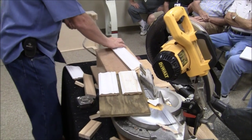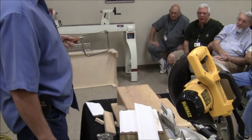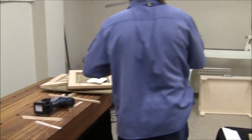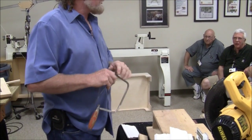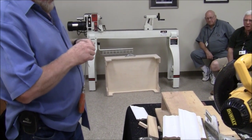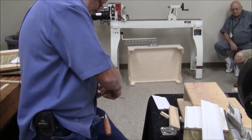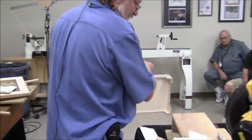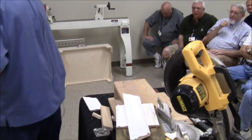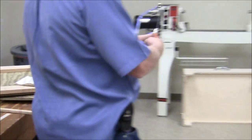Most people can take that crown and go ahead and lay it flat and cut it. Everybody knows you cut with a coping saw on a pull stroke. No, you cut it on a push stroke. The reason is because if you cut on a pull stroke, as you're coming through the face you start to rag — splinter — your face. This is just primer-grade, what Home Depot sells. So we would make up a nice little jig — just two pieces of crown. You set that in there and that holds it in the way it's going to bed on the wall, then you come over and go through your coping process.